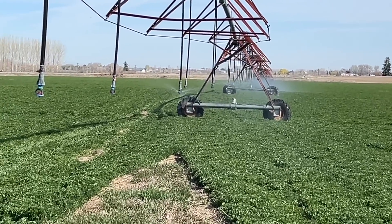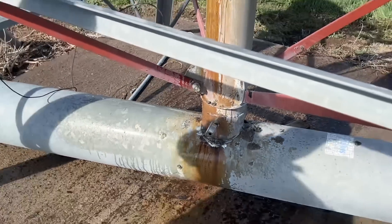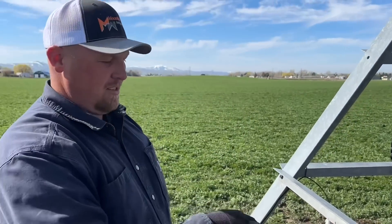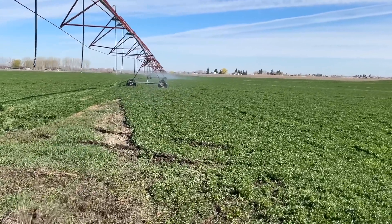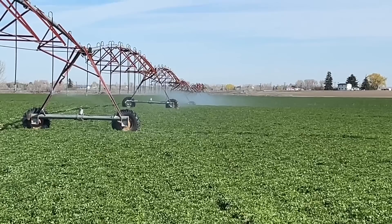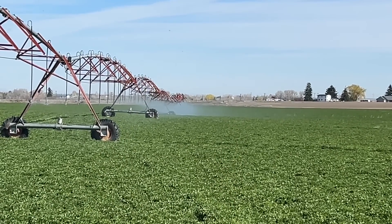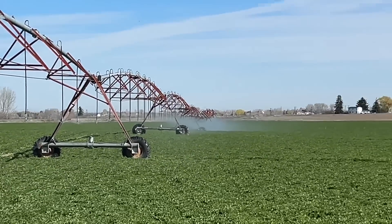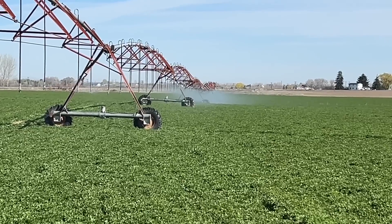It's hard to get all the little holes. As it gets more pressure it could develop more holes, but the little holes should seal up — it's a metal pipe with water in it, it's gonna rust and fill in. The nozzles in the sprinkler drops are bigger than some of these holes, so it's not going to cut any pressure. We're waiting for the end plug way at the very end to blow out — there's a brown stream as big as your arm flushing out all the sediment that's settled in this big pipe. It's running clear now, so we're going to shut it off, put the end cap in, and then turn it on and get it going.